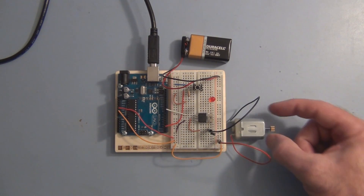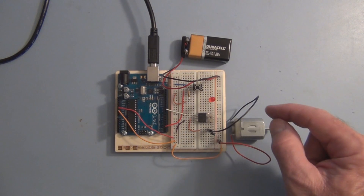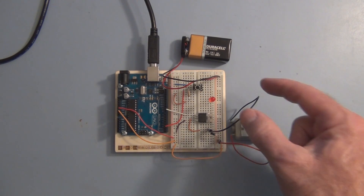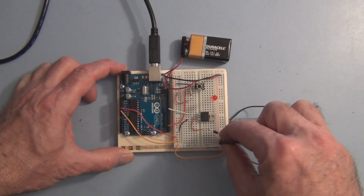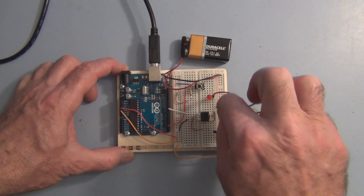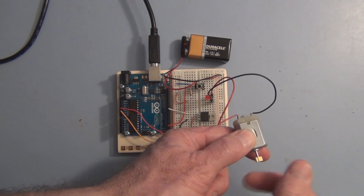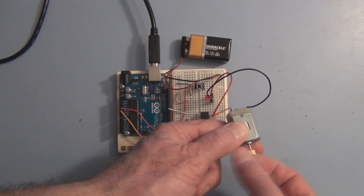The opposite occurs also — if you pass a wire through a magnetic field, a current is generated in that wire, and also a voltage that has opposite polarity to the direction of the current flowing in that wire. We can demonstrate that by turning this motor and showing that it can also be used as a small generator by attaching it to this LED. We'll just spin the shaft here, and you can see it lights up the LED in only one direction. If I spin it clockwise, nothing. Counterclockwise, it lights up the LED.